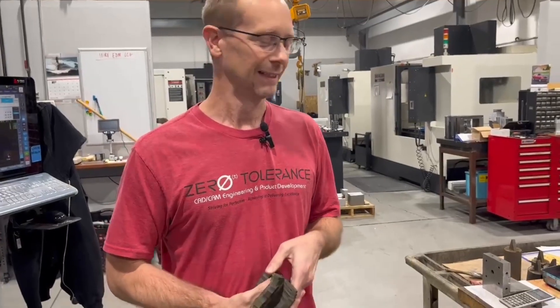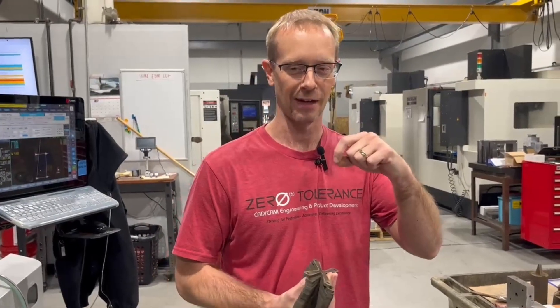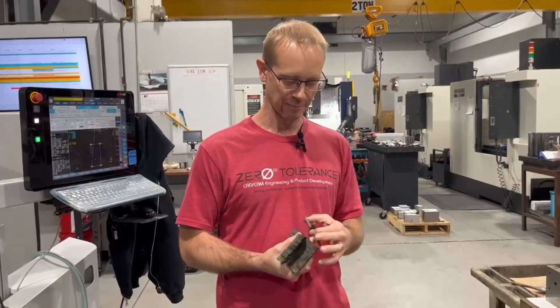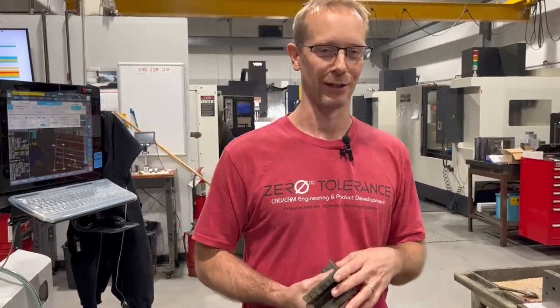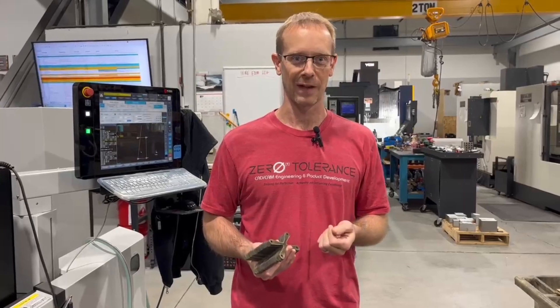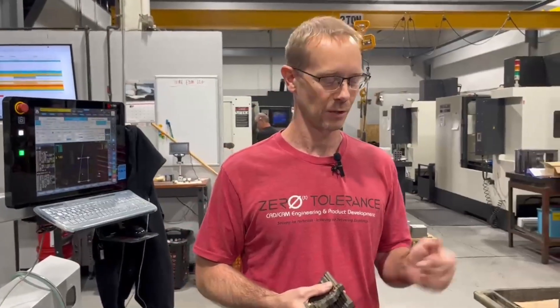We discovered something in our settings when we were wiring these that made a huge difference for our speed. Remember us saying we were running about nine hours on that one setting? We got it down to seven hours, and then we got it back down to about four to four and a half hours for the first profile cut. What we discovered is when we program a spray and we have it at a heads-away setting, it defaults our material thickness to a half inch. So we were running a two-and-a-quarter inch thickness with a half-inch setting, and that was causing all of our extra time. We also did another comparison and found the high-end wire increased speed roughly 20 to 30 minutes faster than the middle-of-the-road wire we normally run. All in all, after running all of these parts, we are still better off with the higher-end wire.